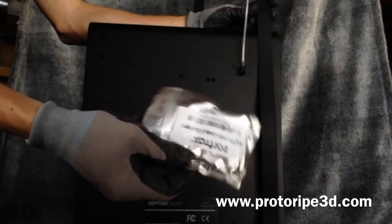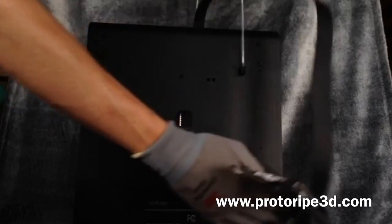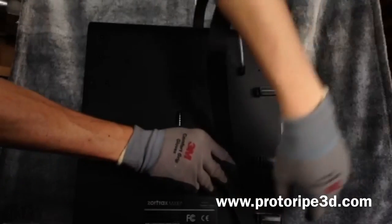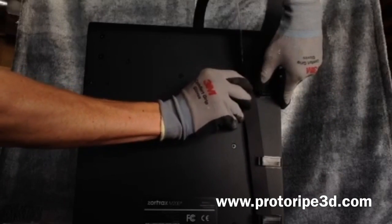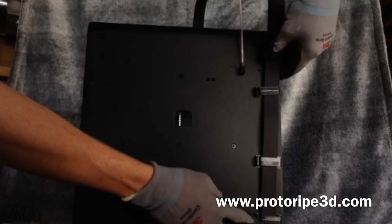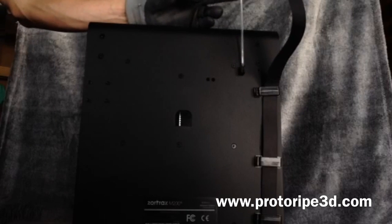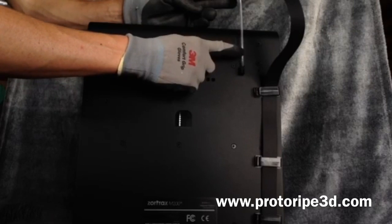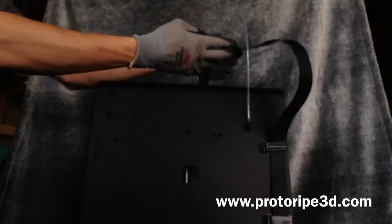Place the sticky cable clamps along the back to hold the extruder cable up, then open them to accept the extruder cable and click each one into place. If you ordered the plus kit, this is the right time to attach the small clips that connect to the cable and hold the filament tube in place to keep the extruder cable elevated.